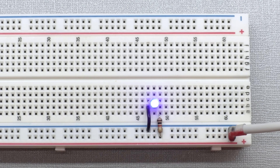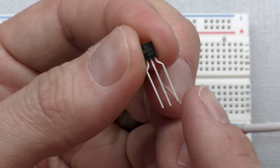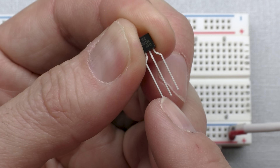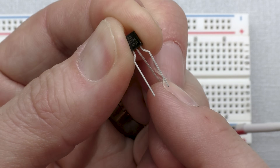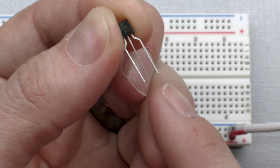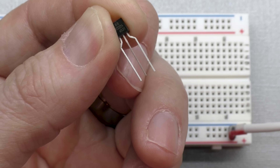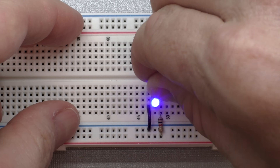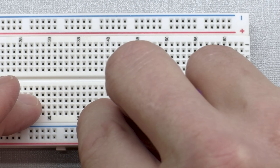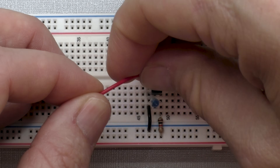The reason I'm showing you all of this is because it helps demonstrate how a transistor works. On this particular transistor you have a collector, which is the first leg, a base, and then an emitter. Think of it like a switch: when you activate the base by applying a voltage, you connect the collector and emitter. What we're going to do is activate that center leg, which connects the outer two, creating a short behind the LED and turning it off.